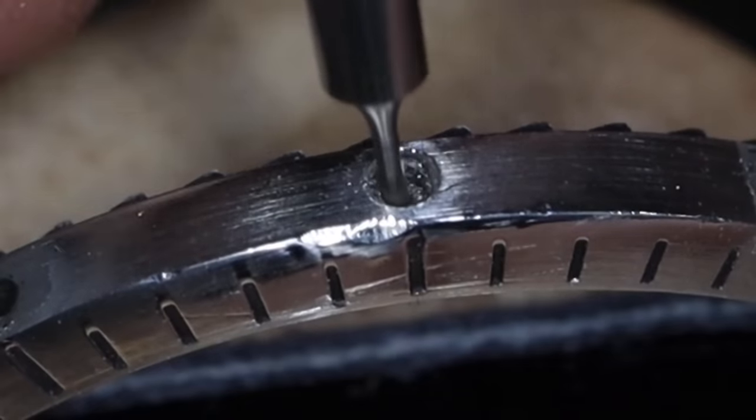Now, there are signs all over this watch that in its 40-year history, it has had some minor water ingress. And this is evident from the chronograph pushers that were rusty. The dial has some patina and staining, and you will see shortly from the movement, there are small bits of rust here and there. Now, the legendary Valjoux 7750 started showing up in watches in the 70s, and this is the early iteration 17 jewel version. The 7750 is still in use by many watch manufacturers today, and it has been improved and refined with a 25 jewel version.